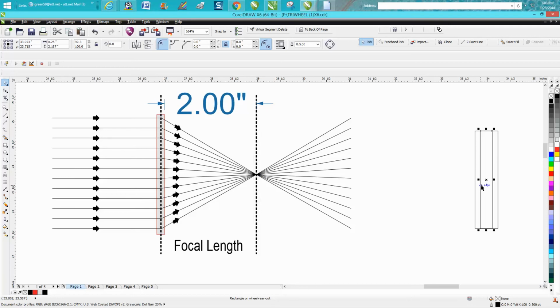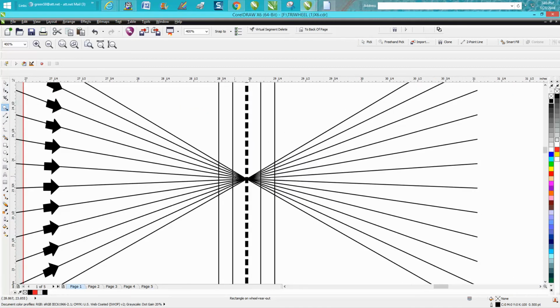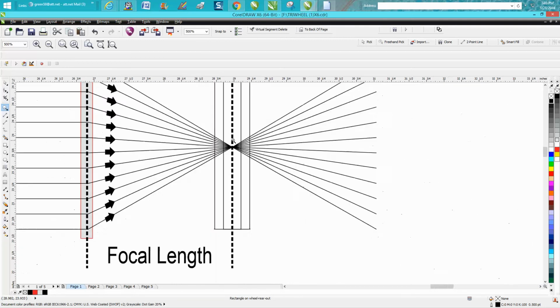This is 1/4-inch material, and you can see how much further it's getting out into the focus beam when the focus beam is larger. Now let's bring in a piece of 1/2-inch, and look how far it is out into the non-focus area. Now you'll get a lot of people saying, and there are some people that cut thicker wood than I do, and I'm not saying they're wrong or I'm right, but you can cut through this with multiple passes and keep changing your focus.